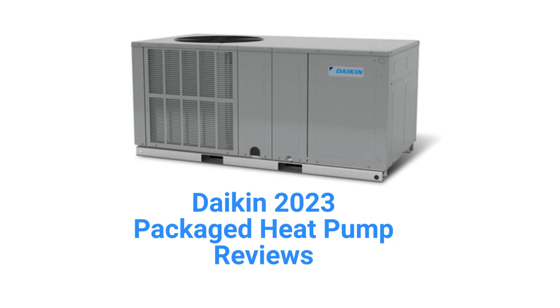This brand offers dedicated horizontal units as well as multi-position models, featuring louvered panel construction which does a superior job of protecting the condenser coil from hail and debris from lawnmowers. They have durable scroll compressors with variable speed blower motors for quiet and efficient operation. The units use all-aluminum evaporator coils which resist corrosion, but they use R-410A refrigerant, which is not as environmentally friendly as brands that use R-32.